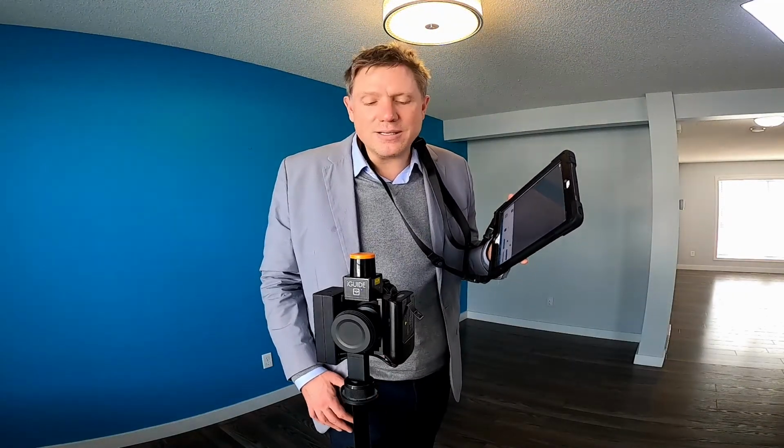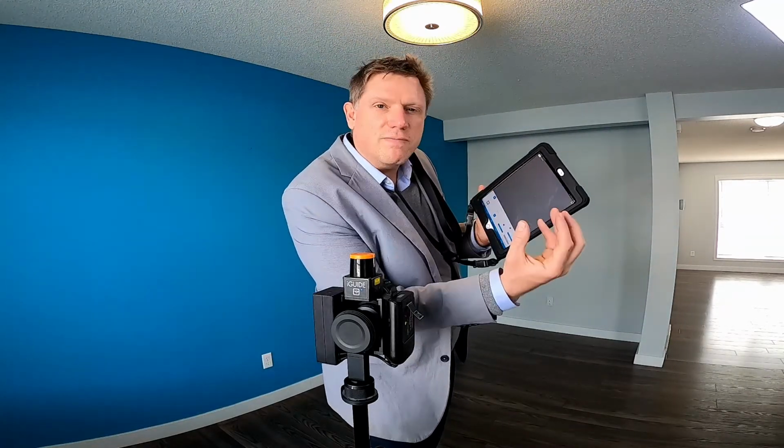camera is in relation to those jigsaw pieces of the floor plan that it's already made. Now, there's an optional mode that's called auto map, and what auto map does is it allows us, before we even start shooting the virtual tour, before we take any photos, we can just walk around with the laser on, and it will do its best to build an entire map out of the property, so that later, as we get those individual jigsaw pieces associated with each panorama, we get the panorama, the 360 photo, and we also get the jigsaw piece of what the laser can see. Now, because we've done an auto map beforehand, it can more easily automatically figure out how those jigsaw pieces fit into the overall picture, okay?